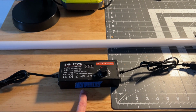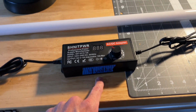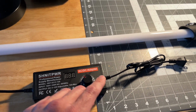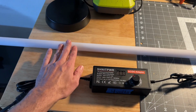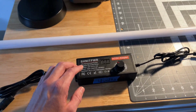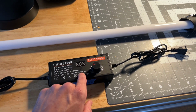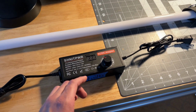Stay at 4 volts. So I just put a little piece of painter's tape on there and wrote 4 volts on there. So please don't forget that. You never want to go above 4.2 volts for this particular setup, okay? Something else unique about this was, we know with the lightsaber blades, we need a lot of amps to power those blades. You got a KR Sabers pixel stick in here, which is the top-notch, highest quality pixel stick we can get for lightsaber blades. The highest amperage AC/DC adapter I could find was 10 amps, which is sufficient for what we're doing here. 15 amps would have been best, but I just couldn't find a 15 amp one, so I got a 10 amp.